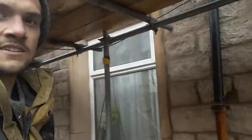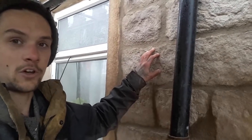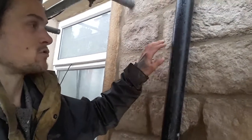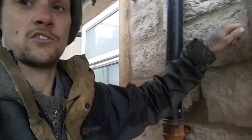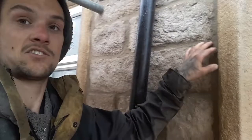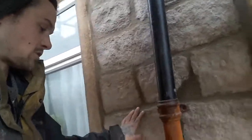The blasters have been in — all the paint's been taken off, all the joints have been ground back, all the lime pointing has come out, so we put the mortar back into the wall. What we do is put it all in, then the day after we come and dress it up — rake off all the fat on the top of the mortar, then it gets brushed back, then we tamp it back with a stiff churn brush, then brushed up again. This is what it looks like when it's finished.